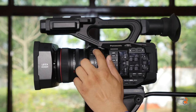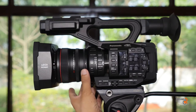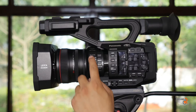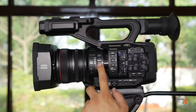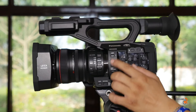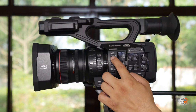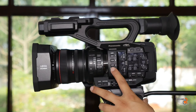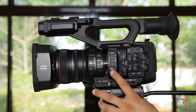There is the camera with 176mm 20x optical zoom. There is a 24mm wide recording with zoom, iris button, and ND filter at 1/4, 1/16, 1/64. There is zoom level control, focus assist, focus auto/manual/infinite and push auto button, and user buttons 1, 2, 3. The button preset is user 1 for histogram, user 3 for SD card slot change, and display mode check.